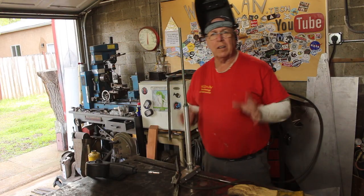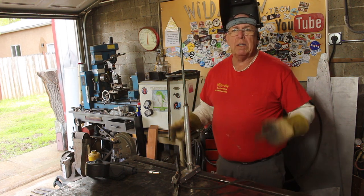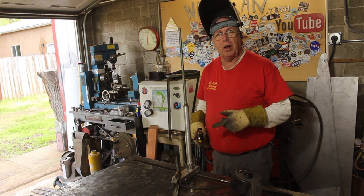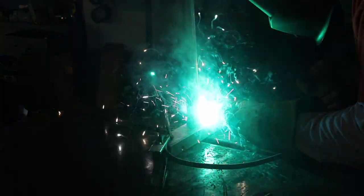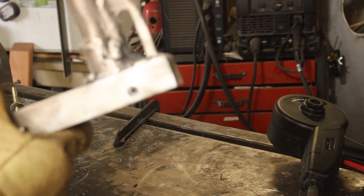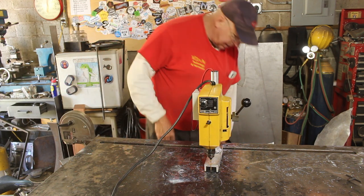Maybe I'll get a better weld this time. A couple things about the spool gun: clamp down your work piece and ground right to the piece, because one of the things it'll do is push the work piece across the table before it strikes an arc - that's one of the reasons I hate this thing. A couple people commented on my complaints that maybe if I preheated the aluminum it might help. Well, that's actually looking quite a bit better - a little bit better than before in any case. It's good enough, and you know what I say about perfection: it's the enemy of good enough. Now this is better. Turn it on - it's stuck. Let's drill something.